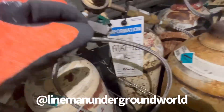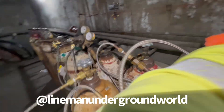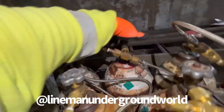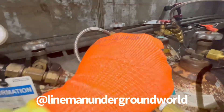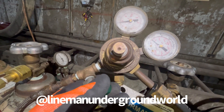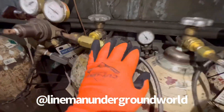We're going to shut the valve here and shut all these bottles down. Then we're going to release the pressure on them so we can start taking off all the hoses. They're all shut off nice and close. Right here we're going to release the pressure — you're going to see this gauge hit all the way to the bottom. All pressure released.